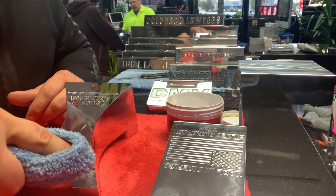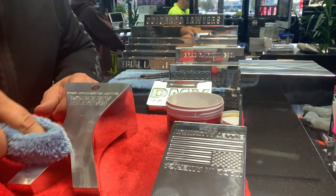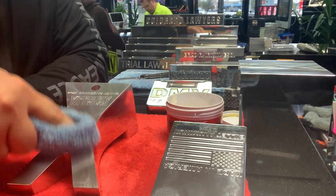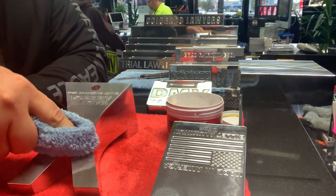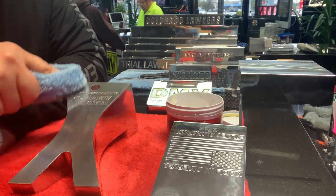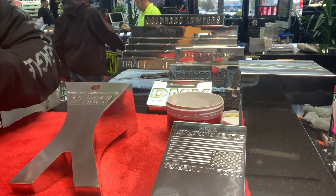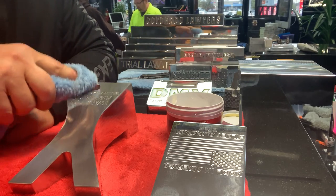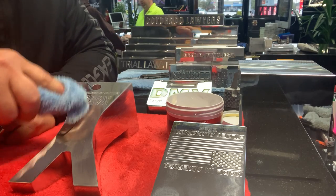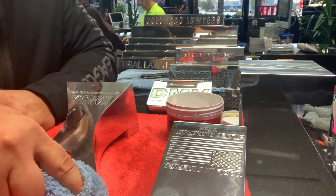I'm going to put just a tiny bit of paste — about this much, not too much at all. I'm not going to rub hard; I'm not trying to put scratches in it or remove scratches, I just want to get that brilliant finish back. There's so many nice things you can buy but there's no real care instructions on what you should do with them. I just wiped it down really lightly. Try to go in the same direction because every time you rub this you put little marks in it. This piece was just done with fine machining and then hand-polished.